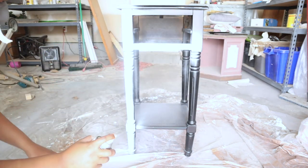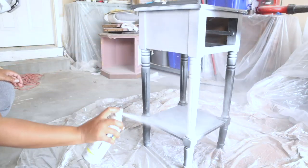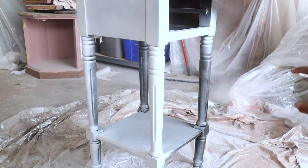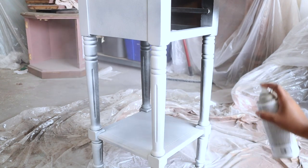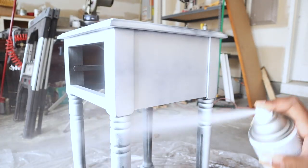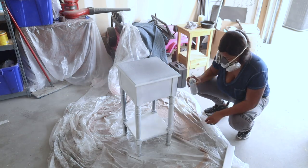The first coverage is going to look terrible, so the main thing you want to make sure you're doing when spray painting is not trying to cover up any areas all at once. If you still see the original color through, just let it dry and then come back with a second or third coat if needed. Also spray paint both horizontally and vertically to maximize your coverage.